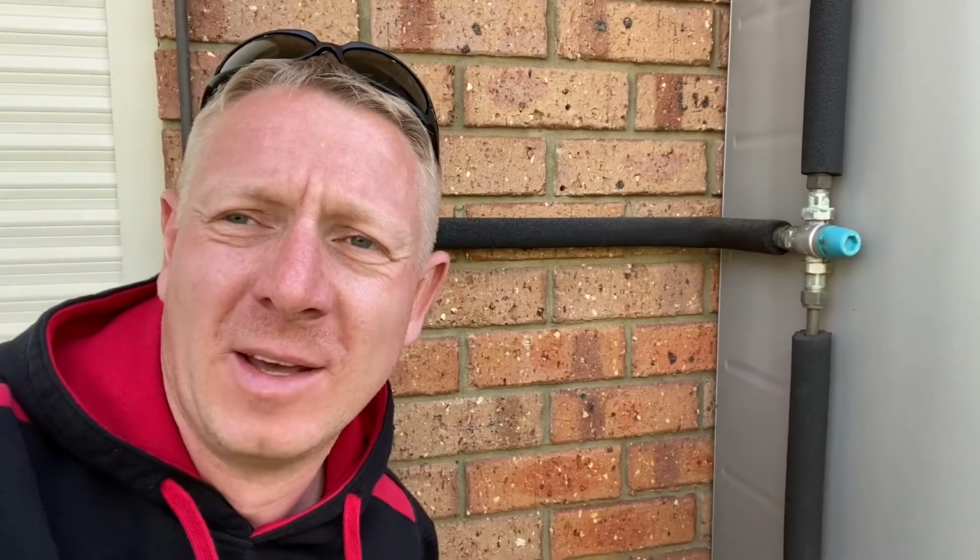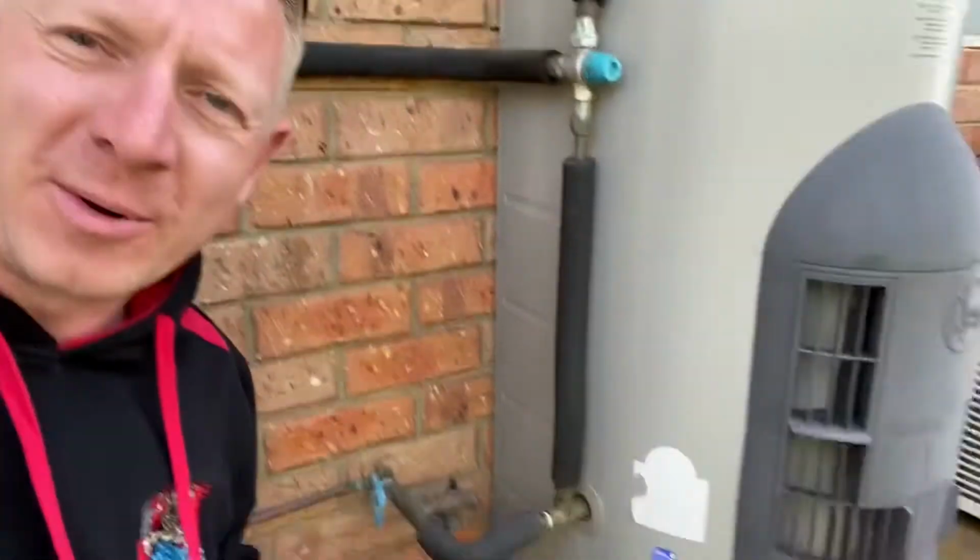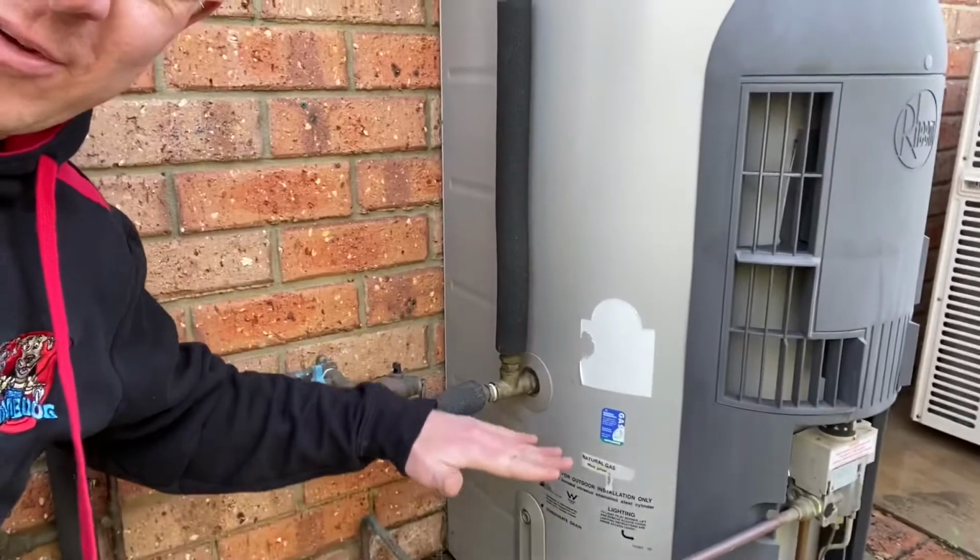So I've done videos previously on how to do a major service on a hot water system, which is to replace the sacrificial anodes in the system and also do a tank flush. So go and have a look at those videos, and you can see how much of the magnesium anode residue comes out of the tanks. Well, that noise that you just heard there is that sign. So the bottom of this tank here will be full of magnesium residue from the broken down anodes and needs to be flushed.